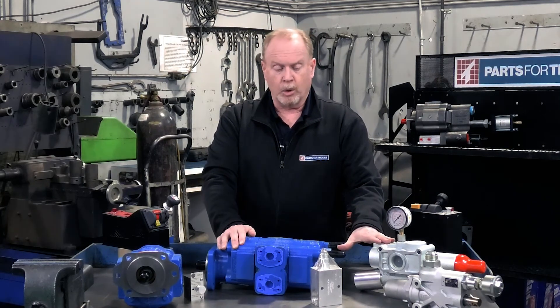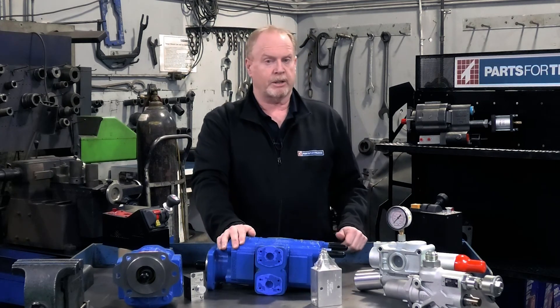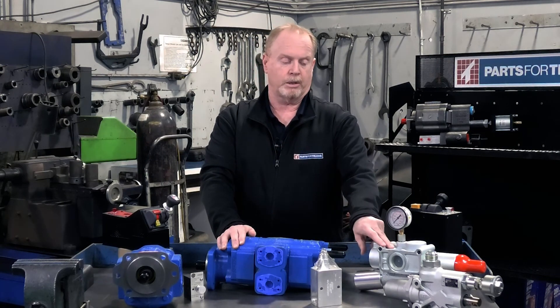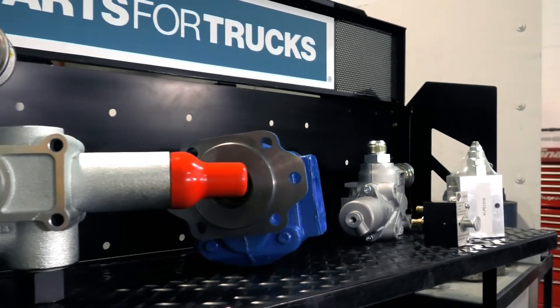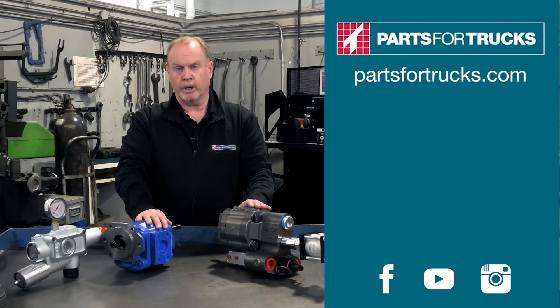When the log loader wasn't needed, we could take the line going through our relief valve and couple that directly back to the reservoir. Then we're running one pressure line through this valve — which we know has a single-acting cylinder spool in there to make the box go up or down. Thanks for watching our video today, and if you have any questions or would like to find out more about what hydraulic system might be right for your vehicle, contact us at any one of our Parts for Trucks branches or at www.partsfortrucks.com.